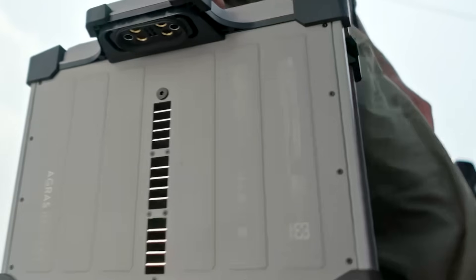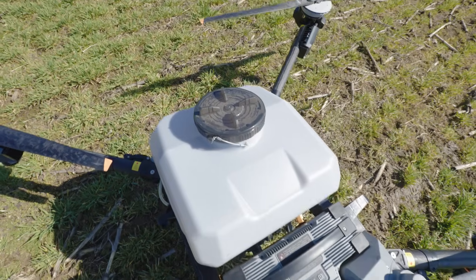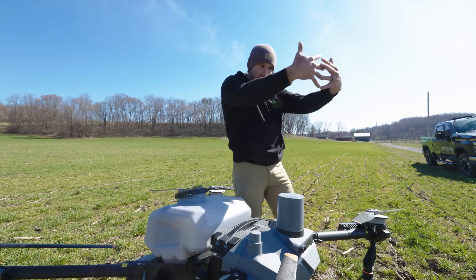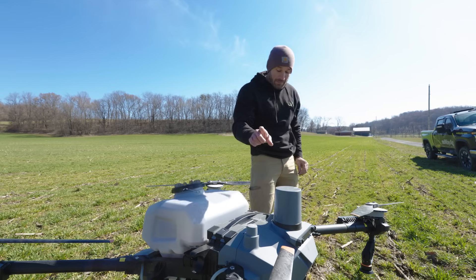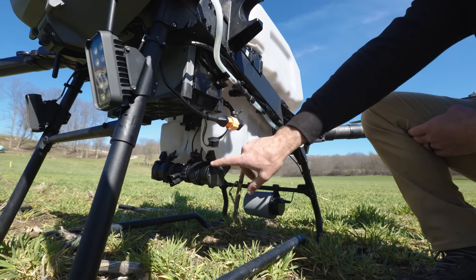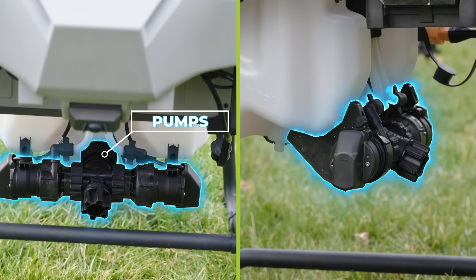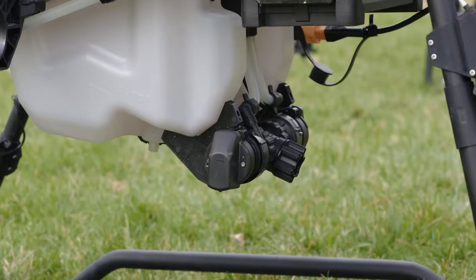Since we're in front of the drone, let's show these fins. The battery has fins in it. If you look at the overall drone, this is the front portion. You have your battery up here where the drone moves forward, so wind is coming through and keeping that battery cool — really good idea. The pumps on the tank are in front of the drone, not behind. I believe that's for cooling, because the drone is usually flying forward and wind is coming across those pumps keeping them cool. It's almost like they shifted and flipped everything around from what you'd expect.